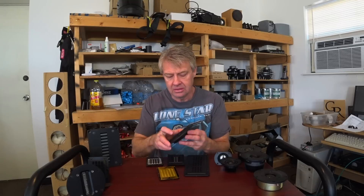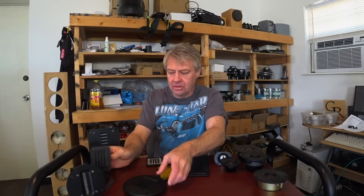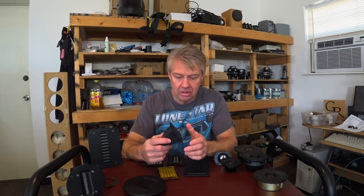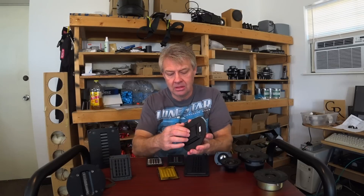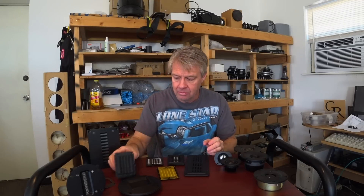Here are some BG units — an early unit with a shallow back cup, and then they went to a deep back cup that was only available to OEMs for a long time. When you put a deeper cup on it, it unloads the diaphragm. The shallow cup creates a smaller airspace that loads the diaphragm, allowing it to play flatter with more of a knee. The deeper cup unloads the diaphragm, allows earlier roll-off but with a nice smooth response.